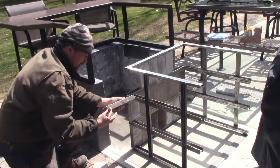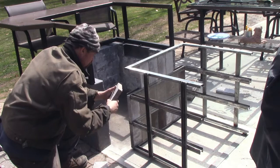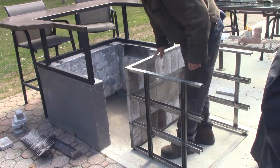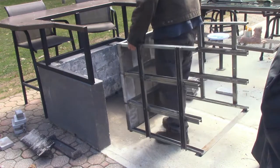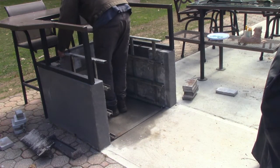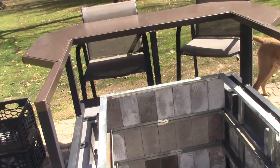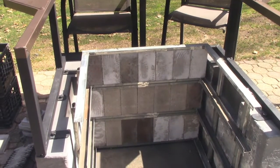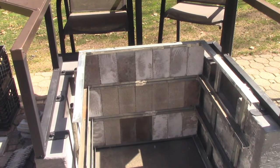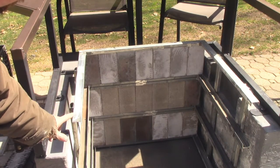The slots are ten inches apart, the bricks are nine inches, leaving a half inch on each side minus the fourteen-gauge material thickness on both sides. This is the part I was a little concerned about — fitting it in — but it slides right in, no problem. The back side is loaded, and now I can load the side bricks from the front. The sun is creating a lot of glare and I can barely see the screen, but that's it. It was easy enough to lift in, and with the bricks loaded this thing is pretty solid.